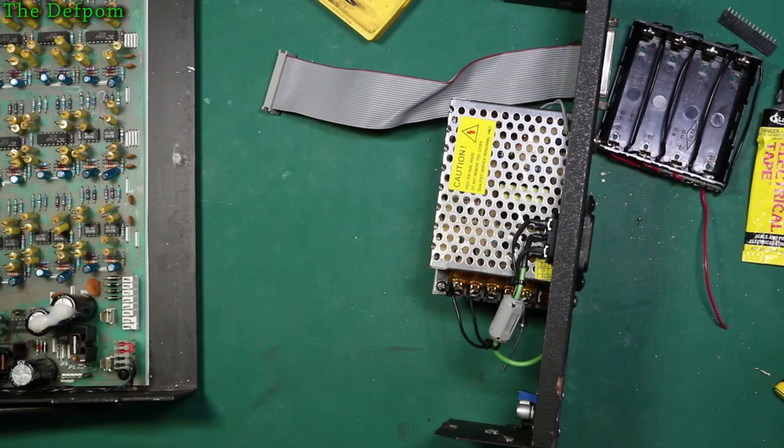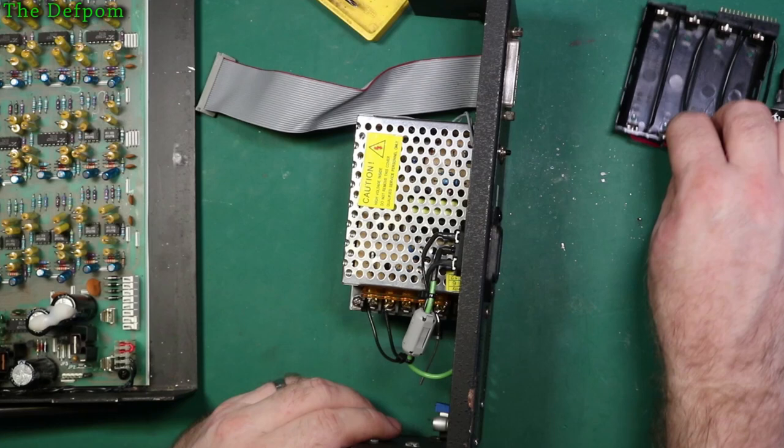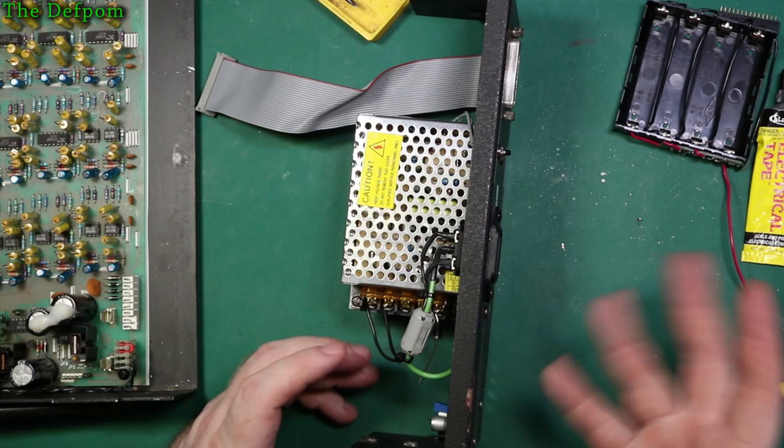I thought that was a Schottky. It's FR302. God, I'm completely wrong. I was kind of in two minds with the Schottky or silicon. The Schottky is obviously going to be a lower voltage drop, and silicon will be, you know, higher voltage drop and also dissipate more heat.